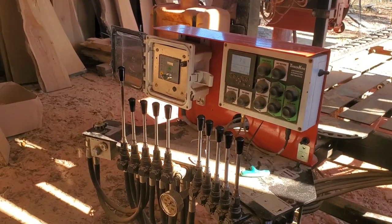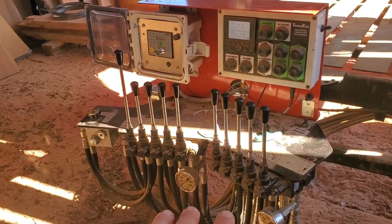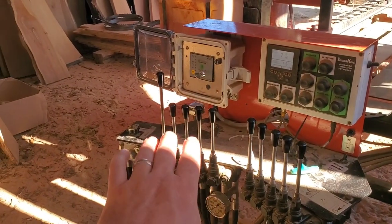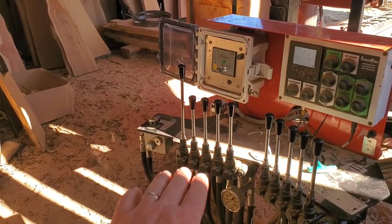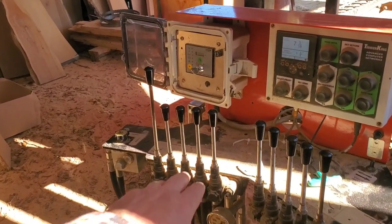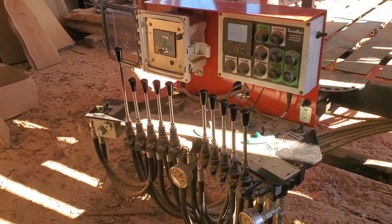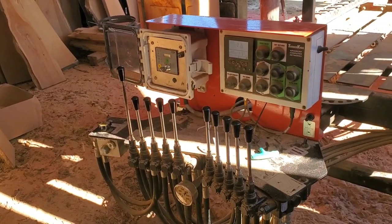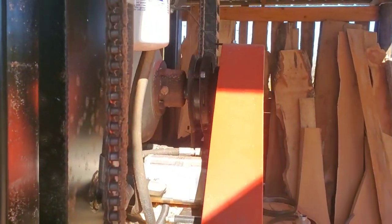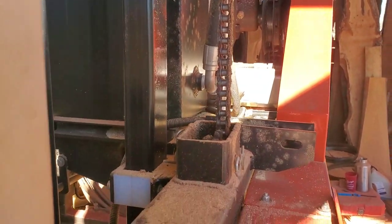I love that on the 2020 and above mills, you have two sets of hydraulic levers, meaning you have two pumps. So you can operate that lever and this lever over here at the same time. You can actually operate on one pump at one time, but you're essentially limiting your power. But I do like how they have two controls, especially when you're turning a log. So you can turn the chain and lift up the turner. You can do some pretty cool two motion operations that are amazing. Really like that design. It's a two stage, or like a pump in a series. So there you go, you got your two hydraulic pumps, that silver thing right there. There's two, one in front, one in back, and they go off the drive belt.